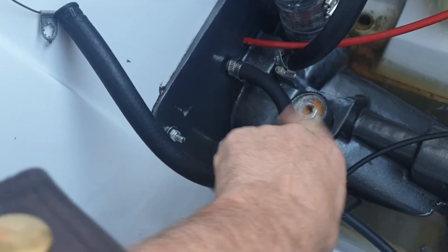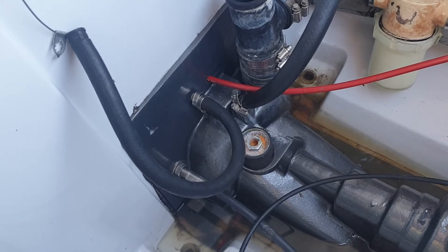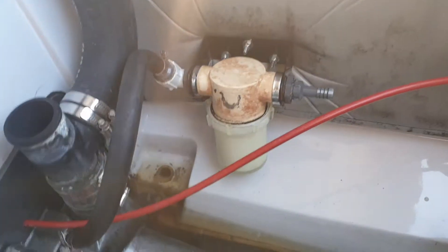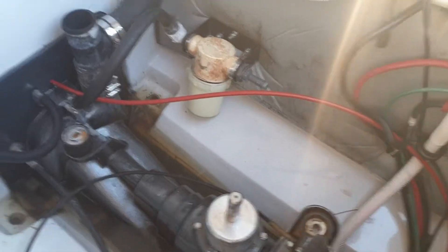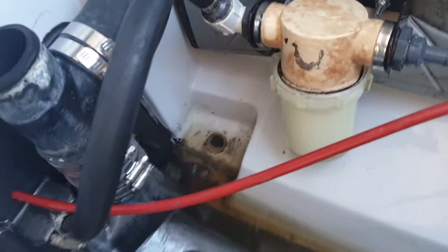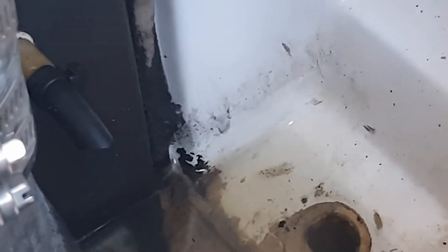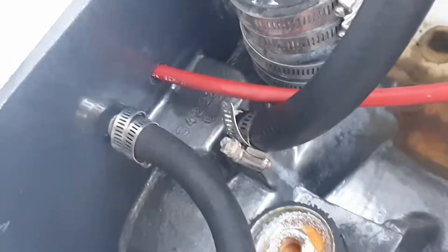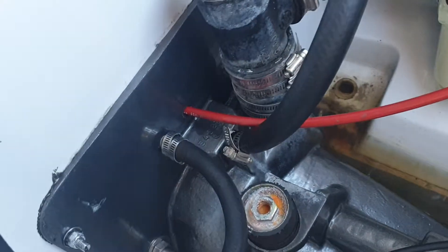The discharge water isn't moving anywhere, which is causing pressure to just build up into the motor — which is a bad deal. That filter right there should be fully disassembled, cleaned, and made sure it's clear, as well as that hose out to the jet pump. There's one other smaller hose that exits — it's hiding down in there, right there — that one has to be blown through and cleared, exiting the boat. There are two exits to the boat.